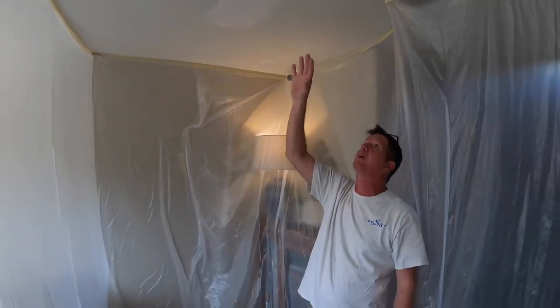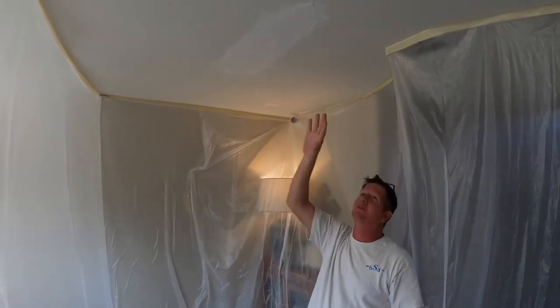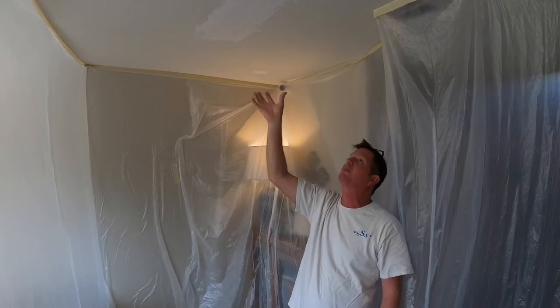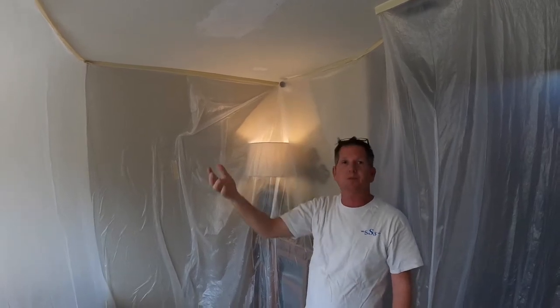So what we're going to do is re-tape it. I'm not positive what kind of tape they have on there, if any. So we're going to re-mud this, scrape it and/or sand it. I think this one we can just scrape the trash off, re-tape and float over it. And then we'll do the texture.